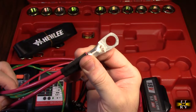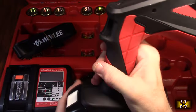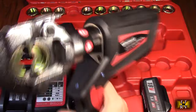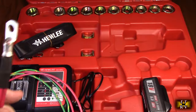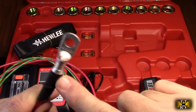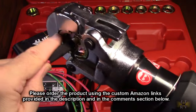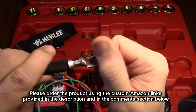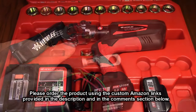This kit includes two 18-volt 5 amp-hour batteries, and each battery will do 300 crimpings — really nice. Here you can see the front headlight, which gives you extra light when crimping in a dark area. Here's a useful trick: I used the four-gauge die but the wires were a little thin, so I went to the next gauge lower and recompressed it — and now it's really locked onto the wires. Do that if you don't have enough wire for the given gauge; it's a way to still get it locked in place.